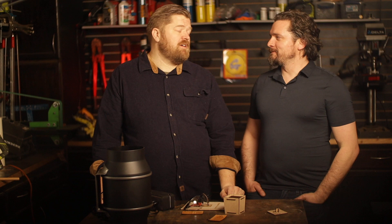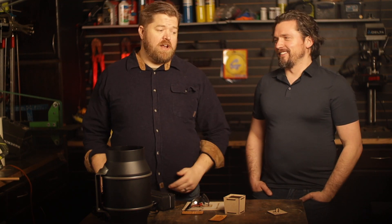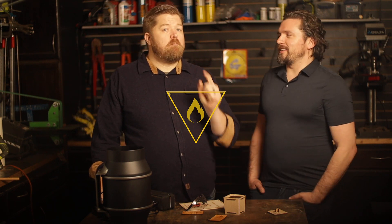The last safety point: don't leave it alone. It's tempting to hit print and walk away, but babysit your laser. From experience — I left the laser while cutting acrylic, which is safe as long as you vent the fumes. But the settings were a little high, and there may or may not have been a fire with melted acrylic all over the inside of the Glowforge. We were lucky. Babysit your Glowforge.